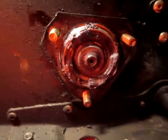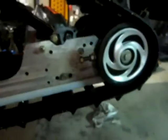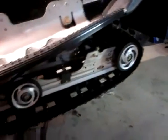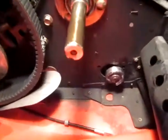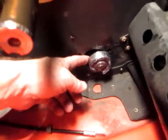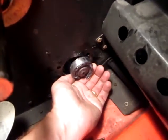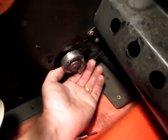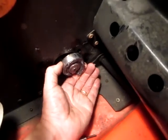Got that cover off. I think I'm going to loosen the track up a little bit and pull it back out of here — that might make it easier to work on. I loosened up the adjusters and got the track loose. I decided to take the secondary clutch off just to make it easier to get at things. There's the bearing. There's a backing plate that goes behind the little gear drive for the speedometer — you take that plate off, the gear drive off, then the backing plate. That appears to hold this bearing in place, and there's no snap ring. So I'm going to have to goof around and get this bearing slid off that shaft.